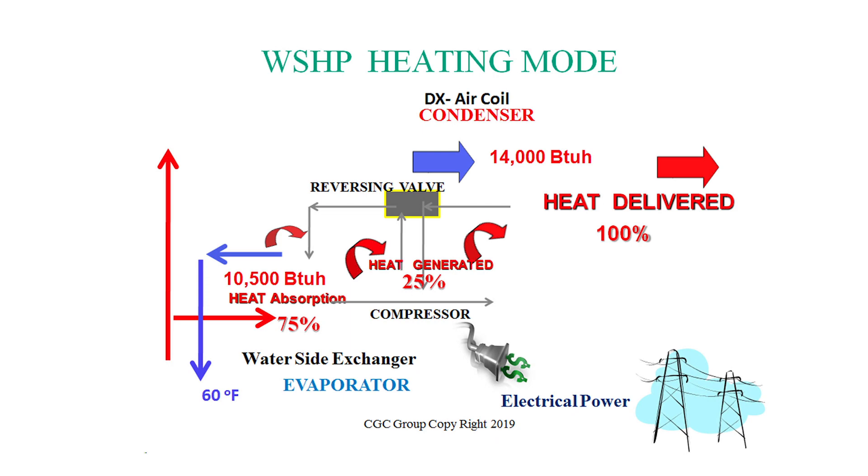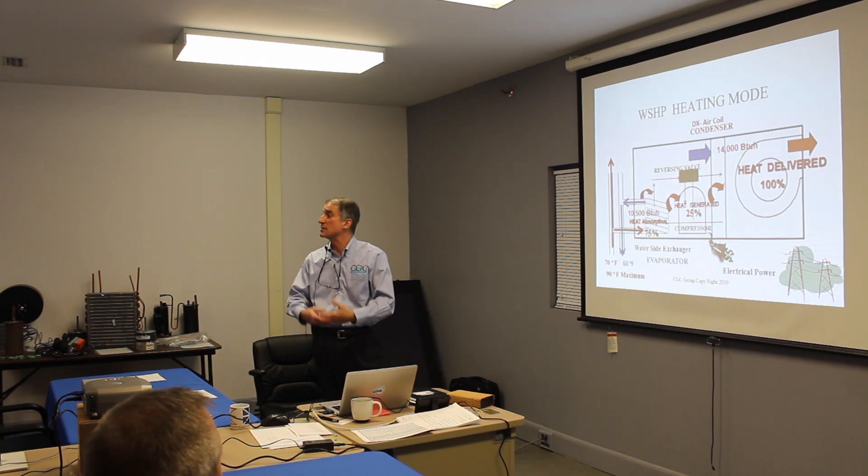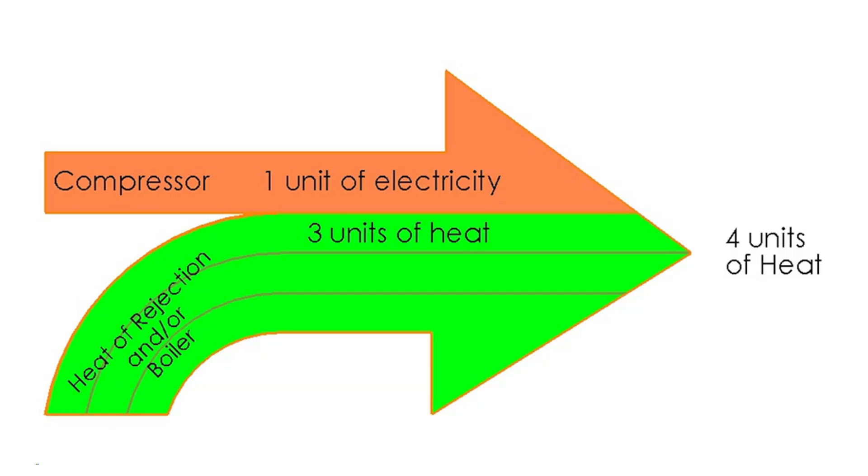It's the same limitation for us if we had to make a reverse cycle heat pump — it's a fault of the compressor in that it can't operate at such high temperatures when it's made for air conditioning. The last thing is that 25% is electrical power, so we're actually consuming electricity in the wintertime to make heat. Of the 4 units of heat we need to deliver to the space, 1 unit comes from compressor electricity and 3 units come from either the heat rejection of heat pumps in cooling or from a boiler. We're paying probably 3 times the price for that electricity compared to, say, a gas boiler — and that's where those energy savings come from.